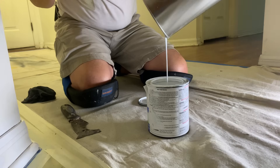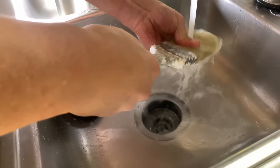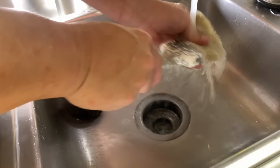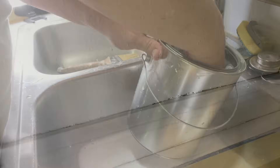Make sure you're always checking your work — go back over it, make sure there's no runs, drips, or errors. A lot of people let their brushes sit around until they dry out and are ruined. The primer needs time to dry anyway, so clean your brush right away.